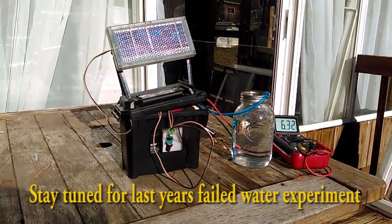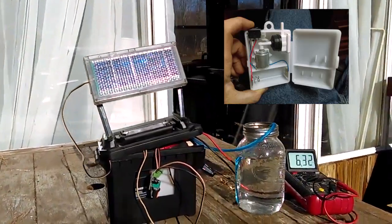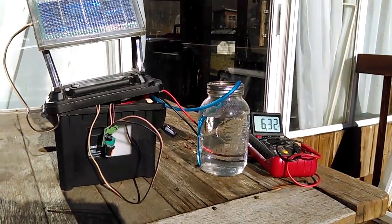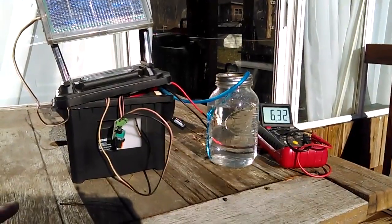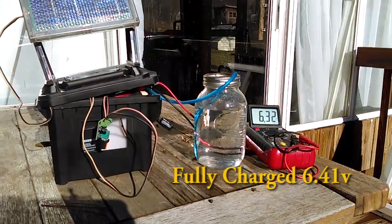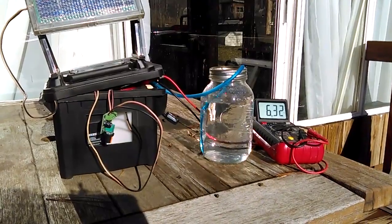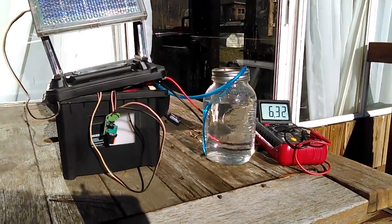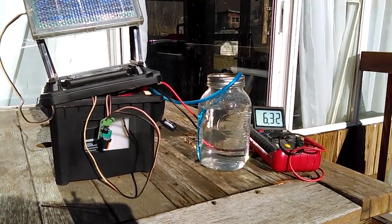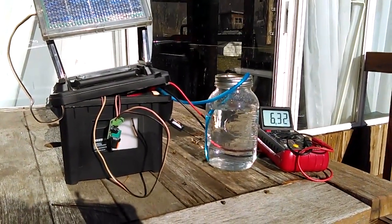What we've got here is basically a battery-powered aquarium pump with a solar charger. I've been playing with this long enough now that I'm able to control the voltage. To give you an idea, 27 hours ago I turned this on and it has not shut off since. When I started it, it had a full battery — it was reading 6.41 volts. It sat in my kitchen overnight and ran all day yesterday on a cloudy day. This morning when I got up about 5 o'clock it was at 6.22 volts, and with the sunny weather I brought it outside and it's hopped back up to 6.32 volts now.